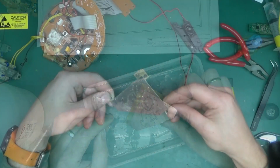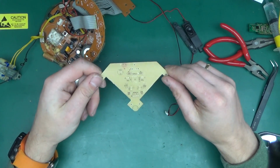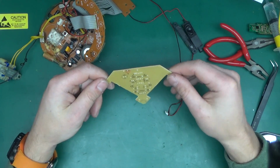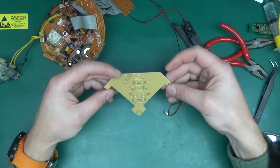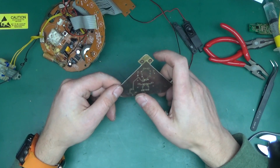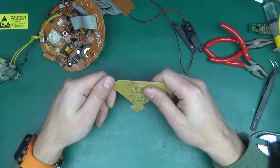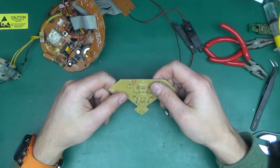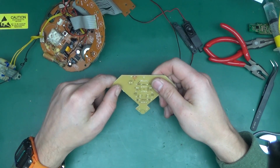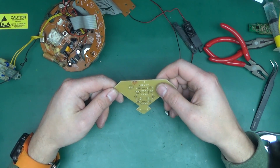And here is the board etched and drilled, and with a bit of a silk screen for the description for ease of assembling. So far so good, with one exception. The footprint for the micro USB port is different to the one that I've managed to find, and I can't find the one that would match this. I didn't check it prior to etching. Oops, not a big deal.